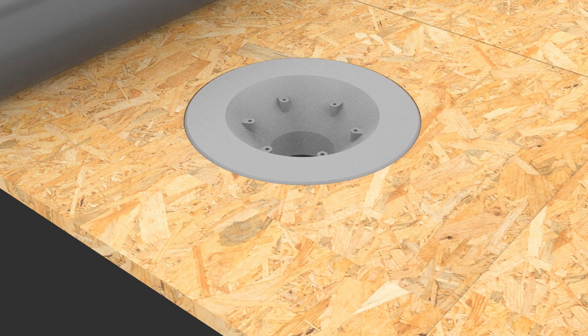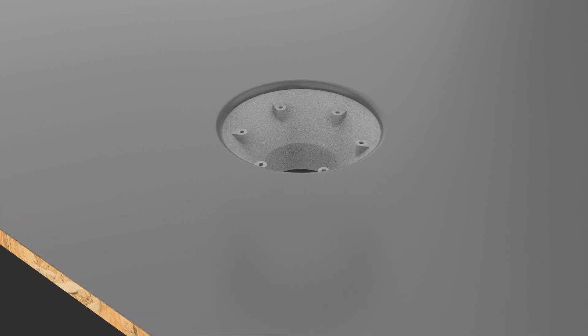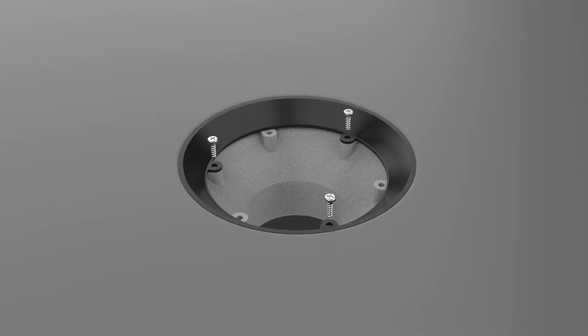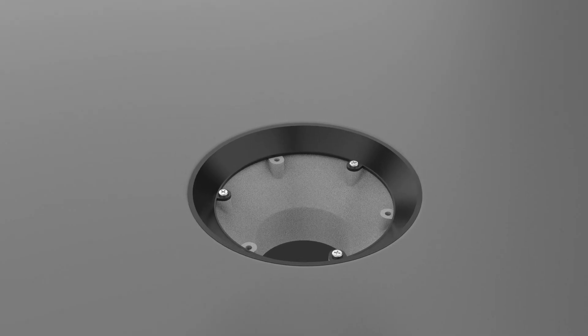Step five: dress a membrane over the flange of the body sump, making sure the membrane does not restrict the outlet or fixing holes. Then bolt the membrane clamping collar to the body using the supplied fixings.